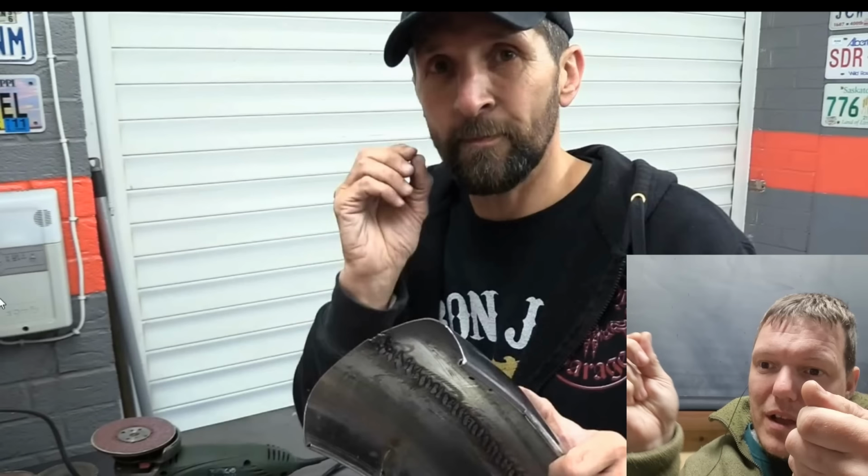With a TIG, that's the whole point, it's separate. You've got melting ability and then you've got adding material ability, and you can sit there and say, that's not melting well enough, or that's not bridged across, and adjust. You have control of them both independently, and basically you're taking control of one of the roles that the MIG does. This is why it takes a bit more skill.